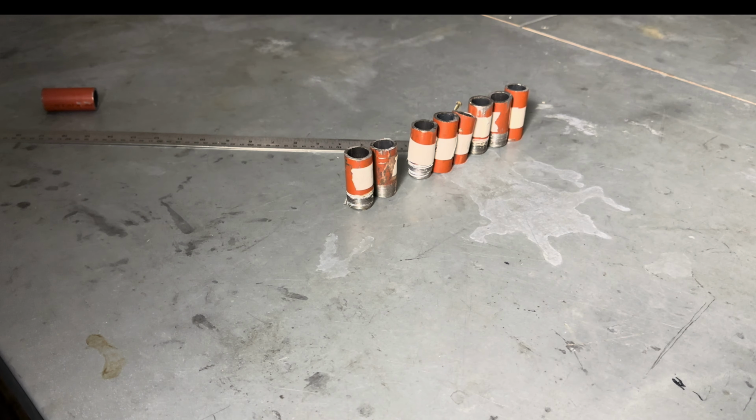Folks, if you get time, I want you to cut some 110mm plastic pipe. This is used in drainage, 60mm long. So what we're going to do for this one, we're going to measure 60mm. Like before, we get a newspaper, that's our line, and we wrap it around, so it's nice and round and it's all in line like this. Then get a pen and draw a line all the way around, like that.